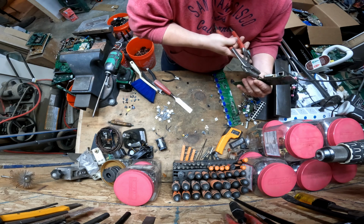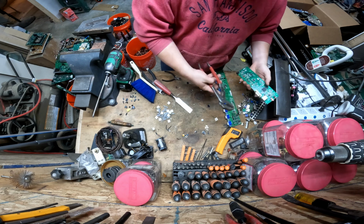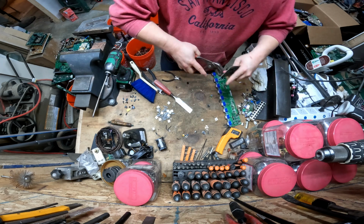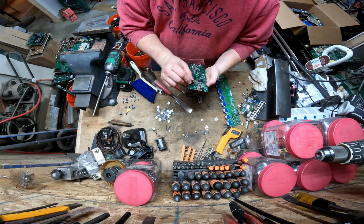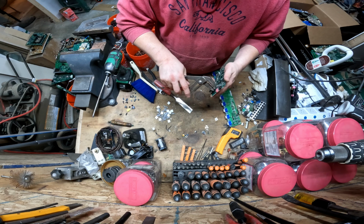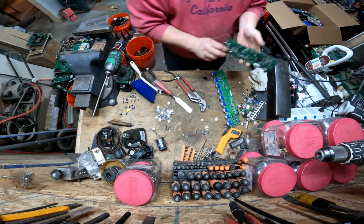This one I'll definitely want to keep separate. Run it through something to remove that plate of gold on it. And all those fingers stay put, and that's perfectly fine if the fingers stay put, because the hammer mill is just going to release all these from the board. Yeah, that's going to go on the higher grade boards.